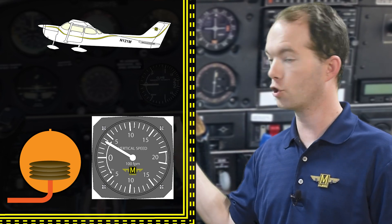This case is designed to leak — yes, you heard that right — and this metered leak is a test question. This causes the aneroid to expand and contract instantly as your static pressure changes, because it's directly connected to the static line, but the case lags behind a bit because of that little metered orifice that the air has to flow through. So when you begin to climb, the pressure inside the bellows drops but it gets squeezed by the pressure in the case, and this pressure in the case is also leaking out trying to equalize — and as long as you keep climbing, there's always a pressure differential, so you're going to show a climb.